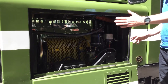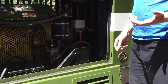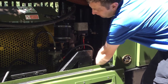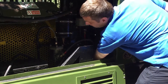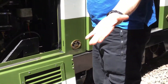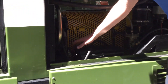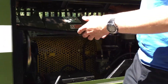I need to check a few things in both these compartments. First of all, you need to check these air tanks — these are manually drained air tanks, so if there's any water in the bottom it will have to be released manually by pulling the chain at the bottom. You can see there's a bit of water and oil coming out. The rest is just visual: check the connections, check the battery connections, make sure there's nothing loose, no pipes leaking or anything else.